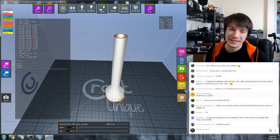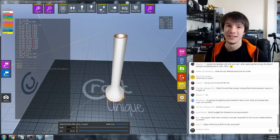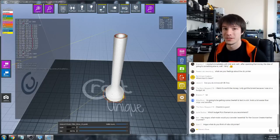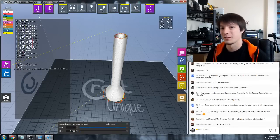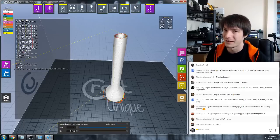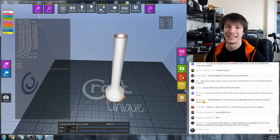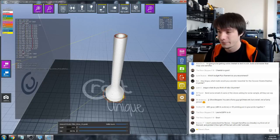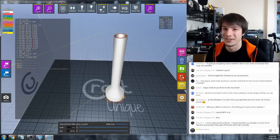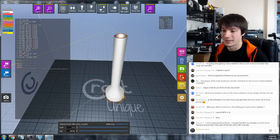Keaton's asking my feelings about the CTC printer. I don't really look at them much because some people get good results and some people just have a machine that's basically a big paperweight. That tends to be the problem with these clones of clones from China where quality control is very low. You're going to be in for a steep learning curve - they do print, but they are very much hands-on machines, not set-and-forget. They are cheap, so if that works for you, then that works for you.